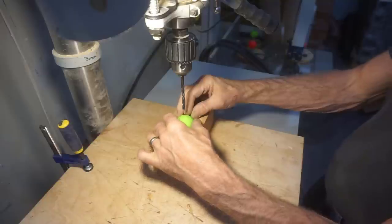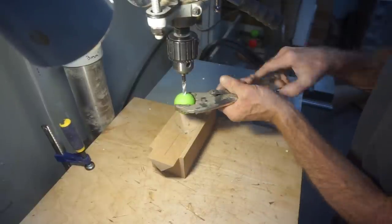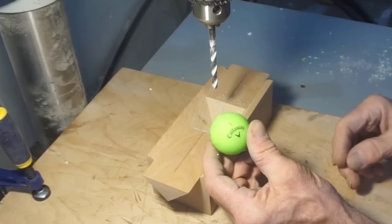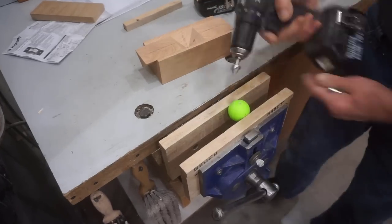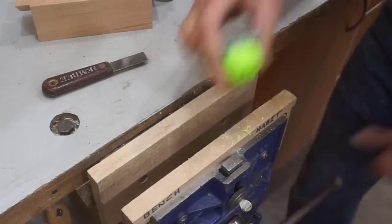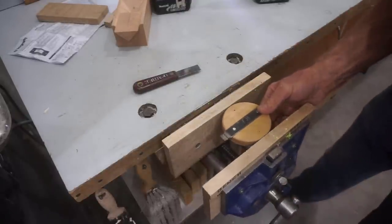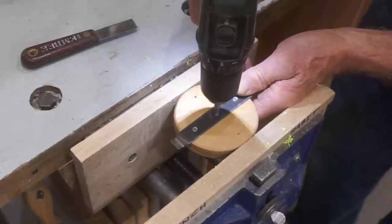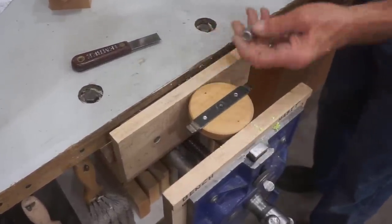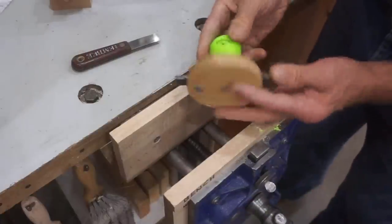After carefully rotating the golf ball so the logo and lettering are lined up, I start by drilling a quarter inch diameter hole about halfway through from the top of the ball. Then I can stop and grip the ball with vice grips to hang on to it while drilling the rest of the way through. With pilot holes drilled, I clamp each ball in the vise and countersink the hole in the top until the head of a three inch long quarter-20 thread Phillips flathead machine screw fits flush, then run the screw through the ball until it's seated in the countersink. I then drill a number eight hole through the center of each clip bar and chase that hole through with the Greenlee quarter-20 drill and tap bit. Finally, I cut a one inch long piece of five-eighths OD aluminum pipe for each hanger and, using the pipe stub as a spacer, slip the screw through the pipe and securely fasten the Callaway to the clip bar to complete the QD hanger plugs.